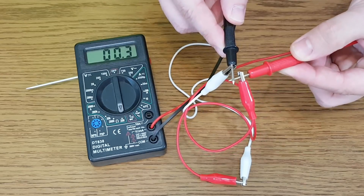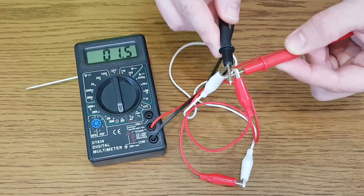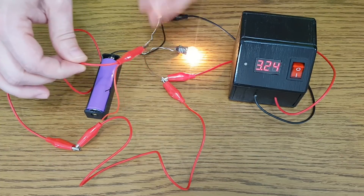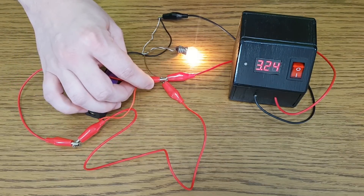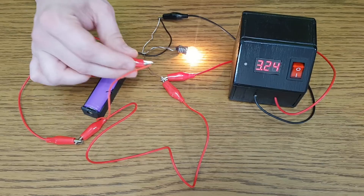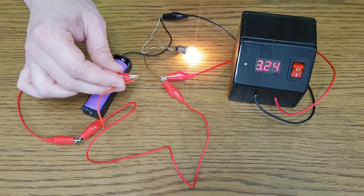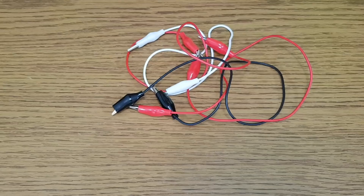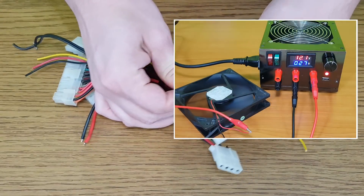Two test leads connected in series have an internal resistance of 1.2 ohms. The longer and thinner the wire is, the bigger its resistance. Here we have a light bulb connected to a battery in series with two test leads. If I eliminate the test leads and connect the light bulb directly to the battery, the voltage increases from 3.2 to about 3.7 volts and you can see the light bulb producing more light. So throw away those rubbish test leads and use short thick wires like these, left over from my power supply conversion video.